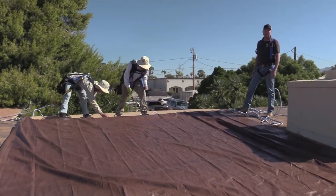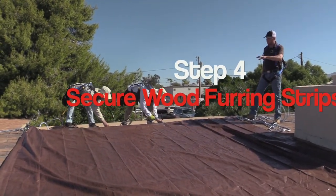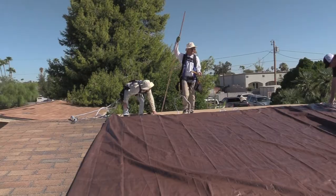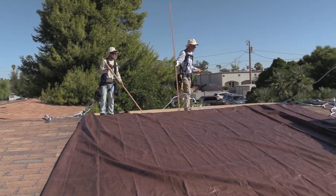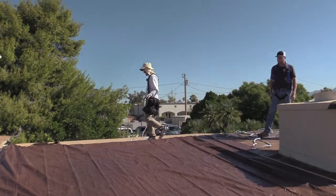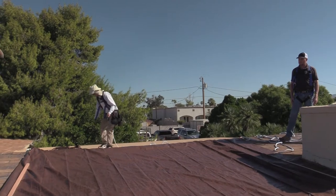What we're doing now is installing the wood furring strips on the opposite side of the ridge to keep this tarp secured. It's not particularly critical that we're nailing to a rafter — we're just nailing to the roof deck. I just wanted homeowners to know they didn't need to be looking for rafters specifically.